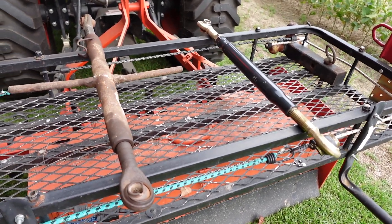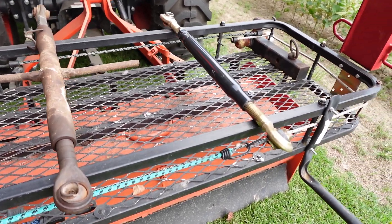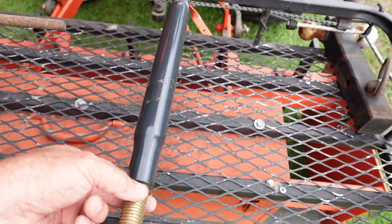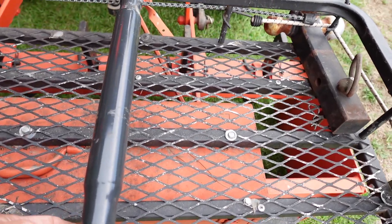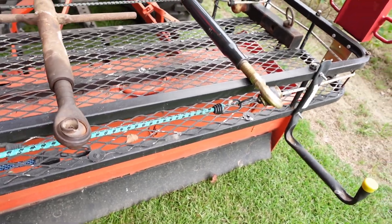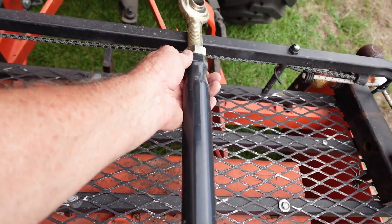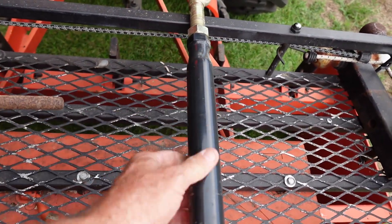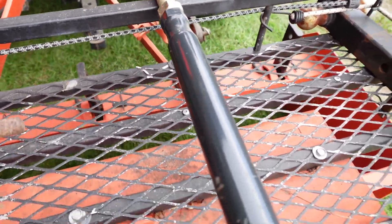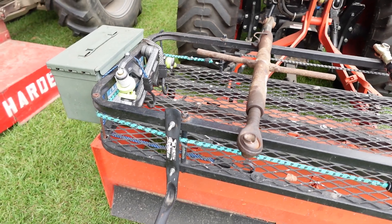It's often in a bit of a bind — you have to adjust the lift to get the tension off of it, and over time grease and dirt accumulate so it's not easy to turn. There's nothing on it, so it's almost like you need a wrench — and I guess that's what the nut welded on the end is for. You need a wrench to turn that thing.